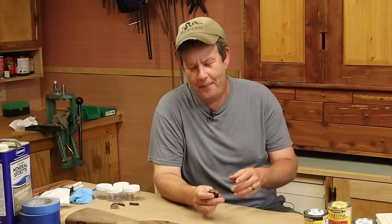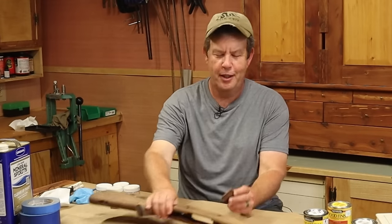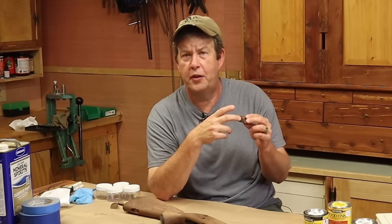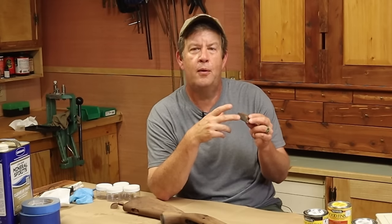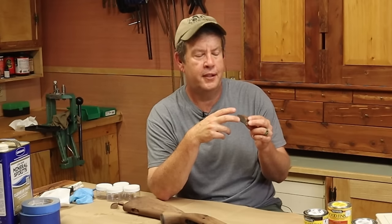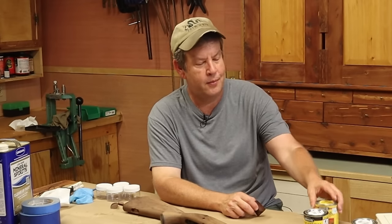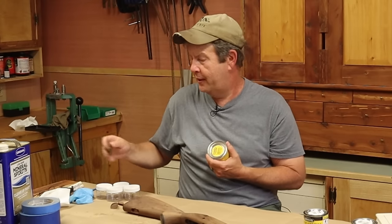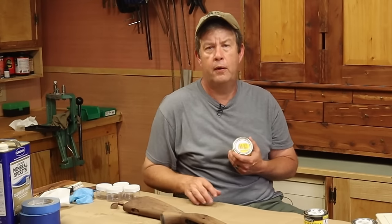Smart man. He makes me feel bad every time I read anything out of that book — and makes me feel spoiled; he made his own tools. So that explains part of why this wood was so dark: because it's old, it's dry, and it's very porous to start with, and it's sucking up every bit of stain. So we're going to see if we can't come up with a concoction between a couple of things here, try it on our test pieces, and see if we can't get a color that works.